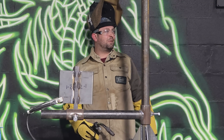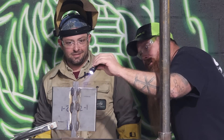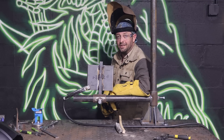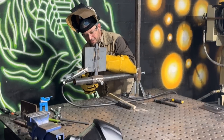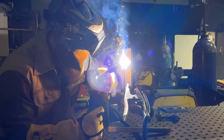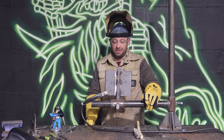Inspector, there's something wrong with your slag — it just blew right off. Good job, man. Get her cleaned up, you got one more pass. I let it cool back down, tested it — we are under 350°F. I'm going to go ahead and put in this last cap. I'm feeling confident. The slag is peeling and I was able to blow it off, which is a good sign. I am a little nervous about the very top of this. We are tied in toe to crown — I hope that little divot isn't going to mess us up.